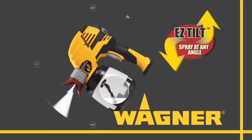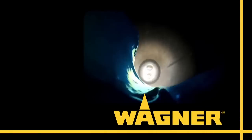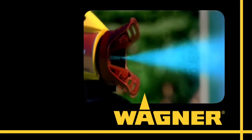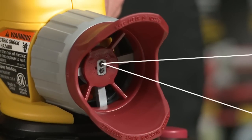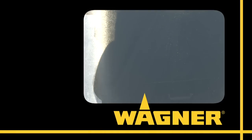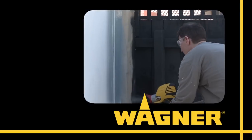And here's another innovation: like all the sprayers in this category, the Power Painter has dual tungsten carbide spray tips that project two parallel streams of material. The area between the two streams is a low pressure zone that draws the two streams together shortly after they emerge from the tips, atomizing the material into particles of uniform size with enough energy to reach and adhere to the surface being sprayed.